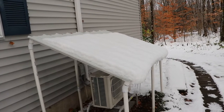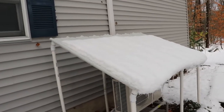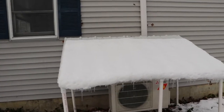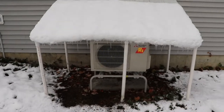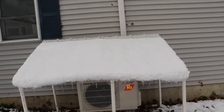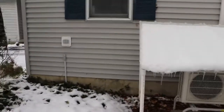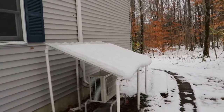You can also just use 90-degree elbows at the corners instead of three-ways, and manually rotate them to whatever angle you want. I kind of like this version because the PVC pipe goes right to the end. The metal on the top is standard width — about three feet — so you can only get certain widths because of the overlap. This one's about six feet wide, a smidge over, probably more than you really need, but I had the space. If you have a very windy area you might want something this wide; otherwise you could chop a foot or two off. It's about four feet deep.